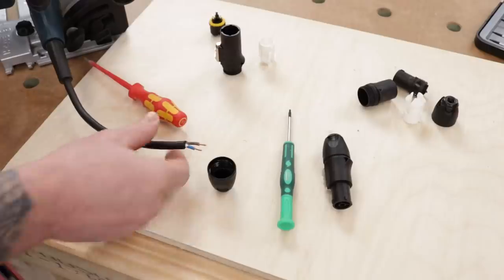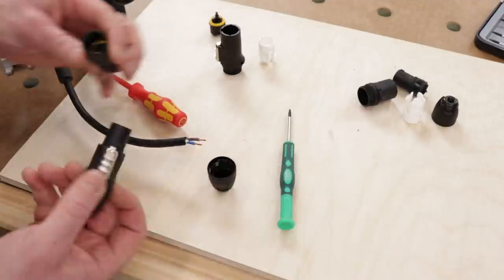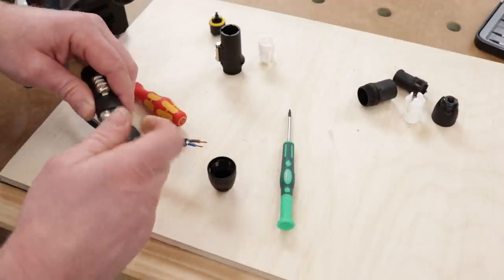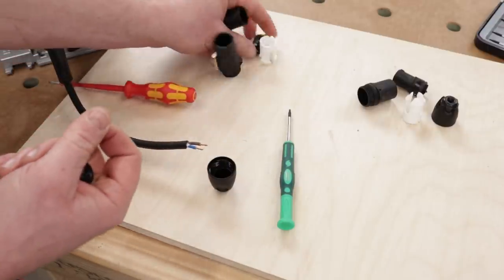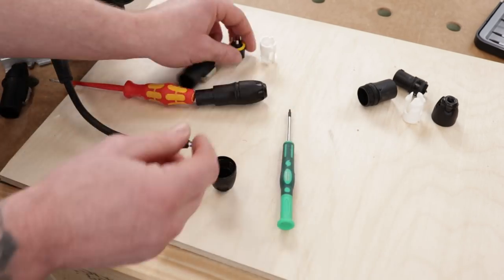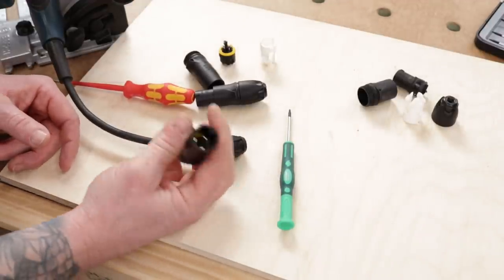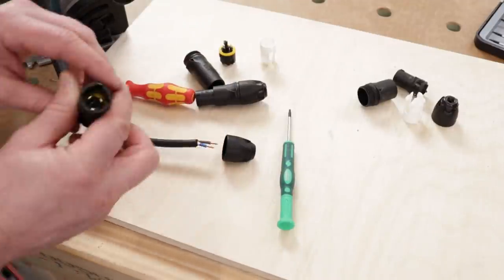Let's fit the plug onto my Bosch track saw. We want to make sure it's the plug end. If you look at this connector there are pins down inside, and the socket fits inside the plug housing. You might think that the outer housing is the plug because it goes inside, but this is your plug because the pins are in here. We never want to have these on the end coming in because the pins can be live - someone could start fidgeting, putting their fingers inside, touch live pins, and have a nasty surprise. So the larger side always goes on the tool.